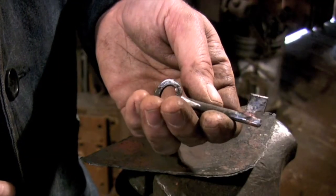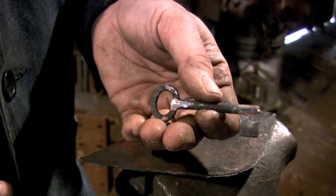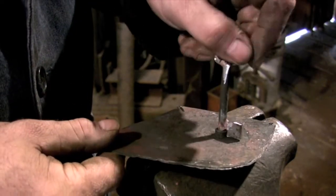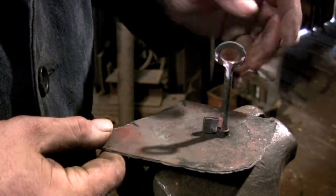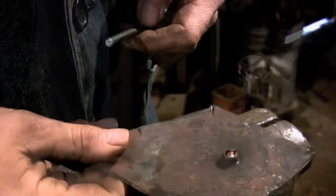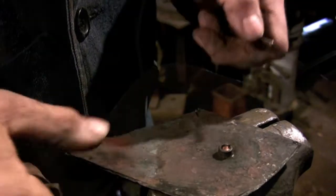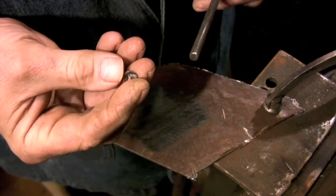Brazing in the fire is a really good way to assemble small parts. We're going to be using it to assemble the key for our lock as well as the ward plate. The ward plate is an internal part of the lock that the key has to fit around to reach the mechanism that opens the lock. The plate is just a piece of 16 gauge sheet metal, and the collar is made by wrapping a thin strip of 16 gauge around the bar stock that I used for the key.